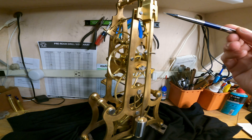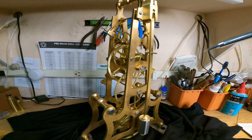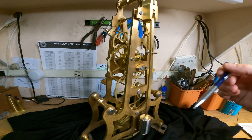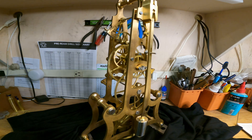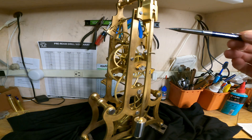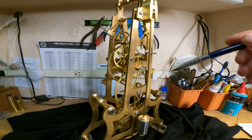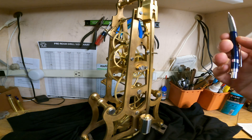I also switched to a smaller spring. On a grandfather clock you'll see a long spring, maybe an inch to an inch and a half, but I think on these smaller desk clocks a shorter spring is better — when you impart energy with the crutch you want it acting like a rigid body. I'd like to hear people's opinions because I've seen it done both ways, but I think the physics argue for a smaller spring. The crutch — you can see how I engaged it in the center instead of using a fork style. I think this works well when you have a square pendulum; if you have a rod then a fork is better, but here I used a square piece of brass stock which works nicely on a skeleton clock.